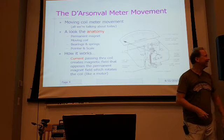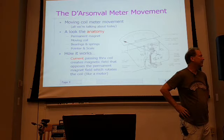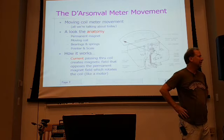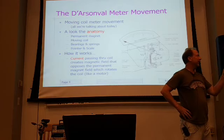The other thing about the Simpson is that the mirror scale used to avoid parallax when trying to make an accurate measurement is not just a mirror scale, it's a front surface mirror scale. That makes a big difference if you're using a Simpson 260, the big wide one, and you want to get a decent accurate measurement. A front surface mirror scale is better than just a mirror. But only the 260s from like Series 6 and on had the mirror scale.